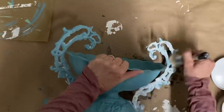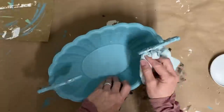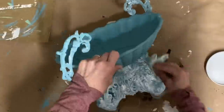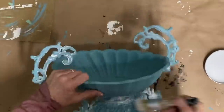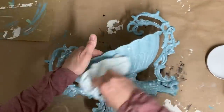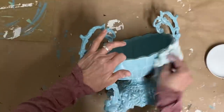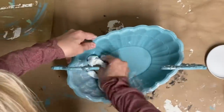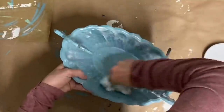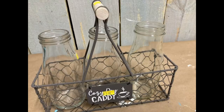I'm just going to take a brush on this one because there are so many little crevices that I wouldn't be able to get to with just a rag. I'm taking the brush and putting a good coat of wax on and then wiping it off. You could use another clear coat to protect it if you didn't want the white wax settling into all the little crevices. You can use any brand of wax — before I was introduced to Dixie Belle I was using the Jolie wax and I really liked it. I do prefer the creamier kind because with the liquid it tends to take your paint off more easily.